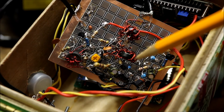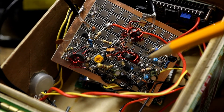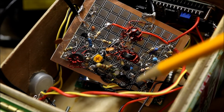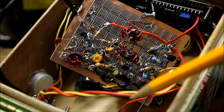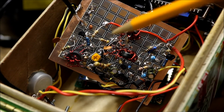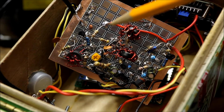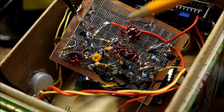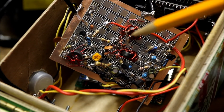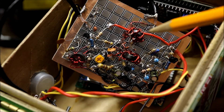We have a DBM here — this is the mixer, which we are using for direct conversion. We're sending out the exact same frequency on the DDS as we are wanting to hear from the antenna. This actually goes to the antenna. I've got a little space here for a bandpass filter, because on 40 meters you need a bandpass filter because of the strong signals. Right now I don't have it — that's my next step on this project.